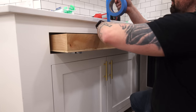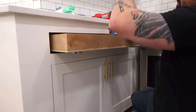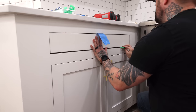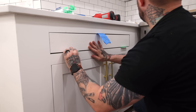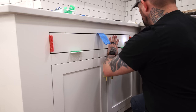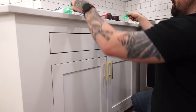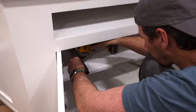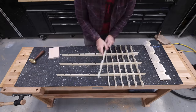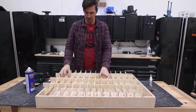There are several different ways to tackle cabinets in a kitchen remodel. We had to build a bunch of our own, but we were able to save all the lower cabinets, which saved a ton of money. I wanted all doors and drawer fronts to be full inset, which lends to a more modern, clean feel. On the lower cabinets I kept all the face frames and had the doors and drawer fronts made to fit the existing openings. With some of the drawers I had to install the drawer slides on the bottom, and I also used my CNC machine to design and cut out dividers to make a spice drawer that replaces the old one.